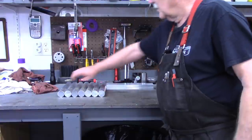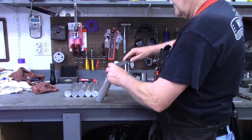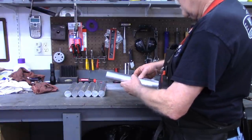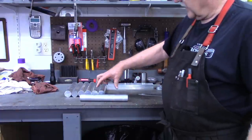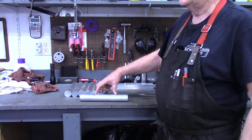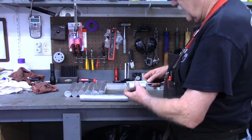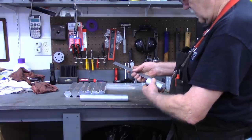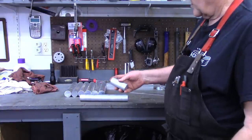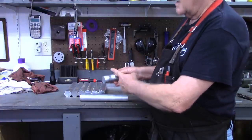This is the material we'll be using to make the cylinders out of. This is inch and a half by — I believe these pieces are 10 inches long. What I did first was divide this into three equal pieces and parted them off, so I wound up with pieces that are just a little over three inches a piece, about 3.2 inches by the time you allow for the saw cut. This will make two of the cylinders — make one on this end, turn it and make one on that end, then we'll part it in the middle.